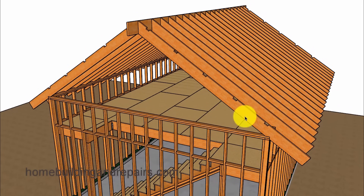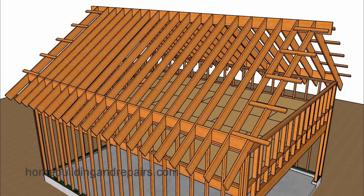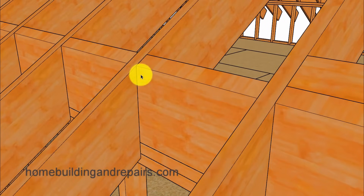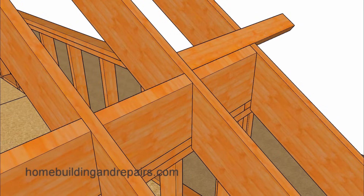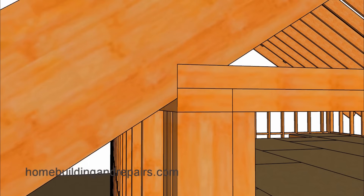Let's take a look at the roof rafters — I am using 2x10. We will need to notch the gable-end rafters for our lookouts, which are the supports for the fascia board on the gable end. I like to use shaped blocks so we can get some perimeter nailing or diaphragm nailing for the roof sheathing, helping it connect to the wall framing more easily. You could always install more building hardware — I will go over that in future videos. Also, a seat cut like this could create problems for nailing shear panel; if that's the case, install the shear panel first and then the roof rafters.